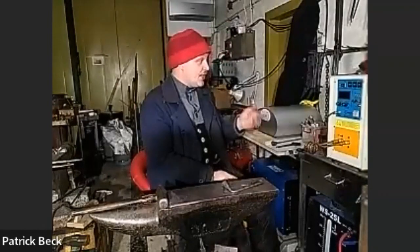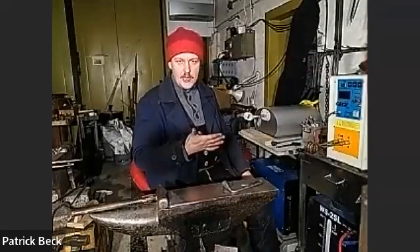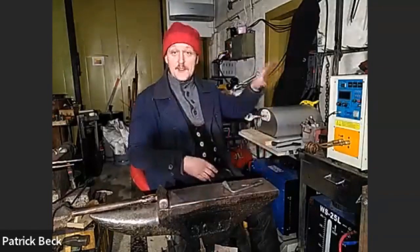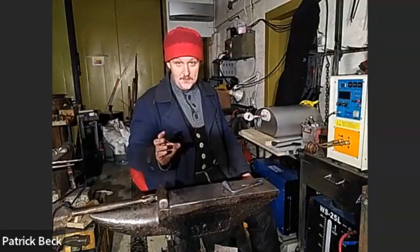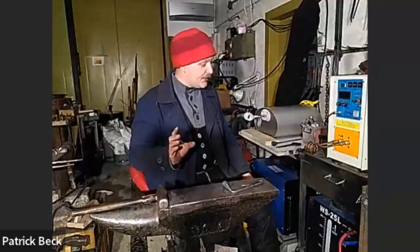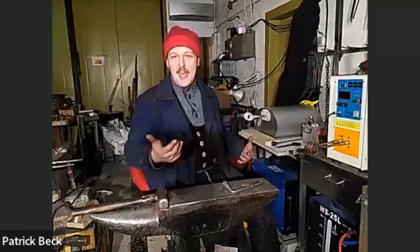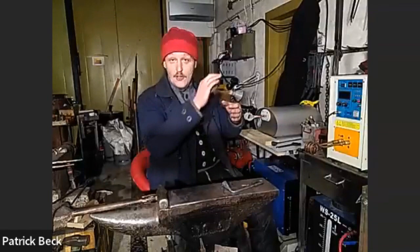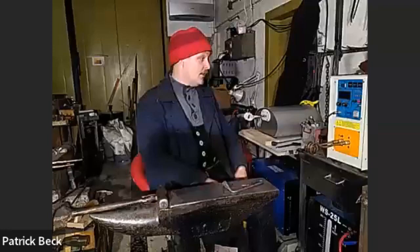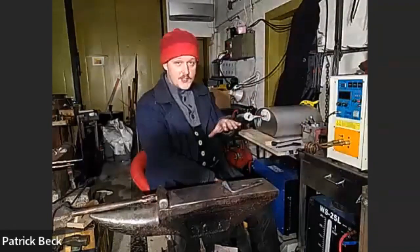What you should worry about is the cooler pressure. Both machines specify three to six bar of constant pressure. I lost about a month because I used a garden pump that delivered eight bar but not constantly - under resistance it lowers the pressure, which you don't want. A car cooler pump or washing machine pump might work, but you need the pressure constantly and without variation.